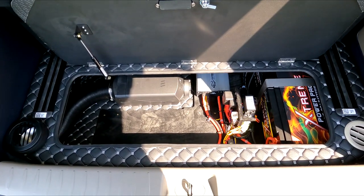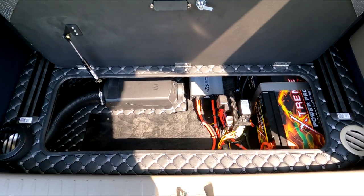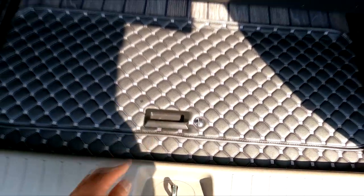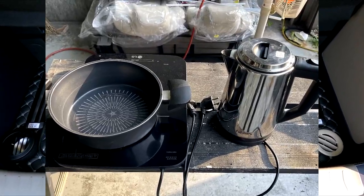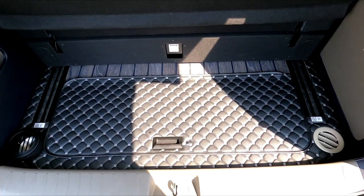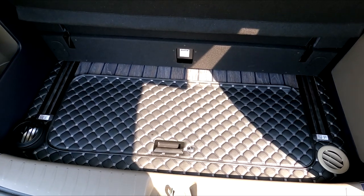The inverter was not selected for this build. As explained previously, using 220V AC power is inefficient. So rather than using an induction cooker or electric kettle at full power, it's better to use a 500W-or-less camping induction cooker and a 12V coffee pot — that's the best way to conserve battery power.